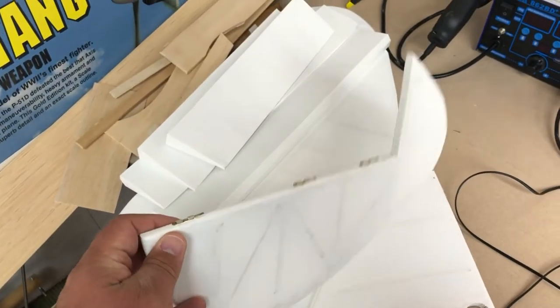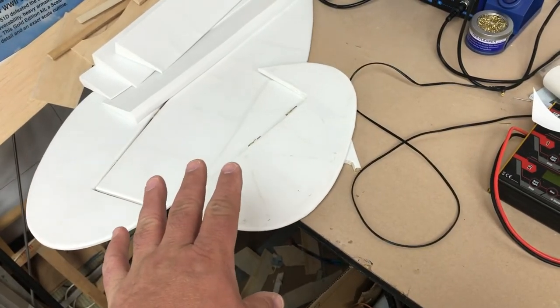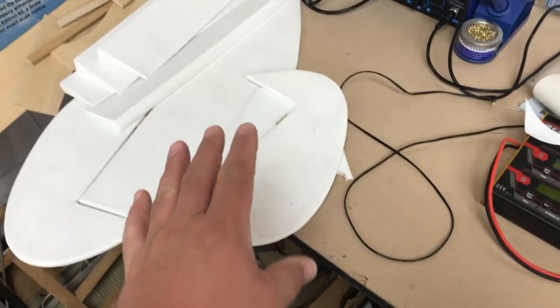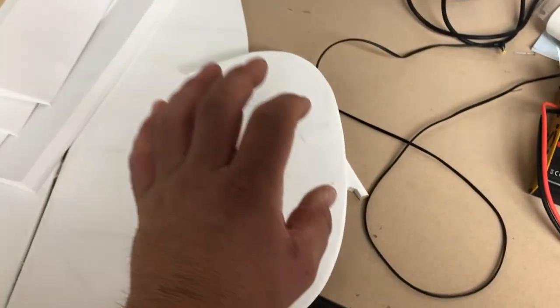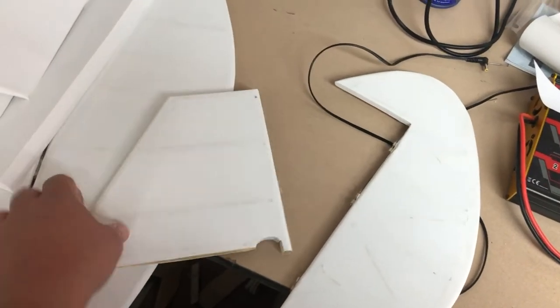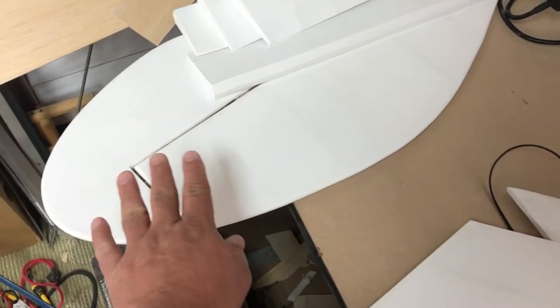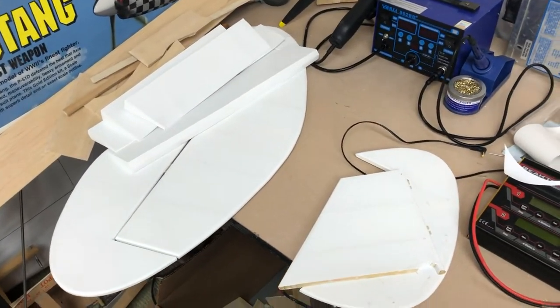Some of them I chose not to have the hinges removed. The rudder looked like someone had taken splinters, threw them into a wood chipper, and then pieced them back together — so there was a lot of here-and-there work on the rudder specifically. Everything else was pretty straightforward. These two cross members in the V-stab came loose, so I re-glued those. There were several things loose in the H-stab — CA took care of that. There were a couple of bigger gaps in the elevator that I used Gorilla Glue for. So not a huge deal on the tailplanes.